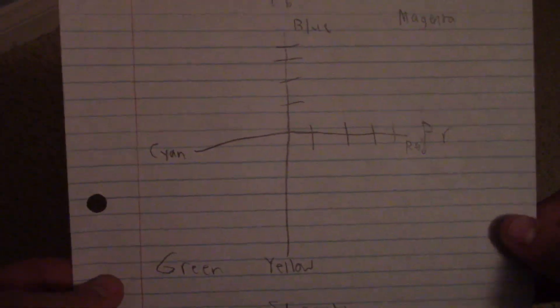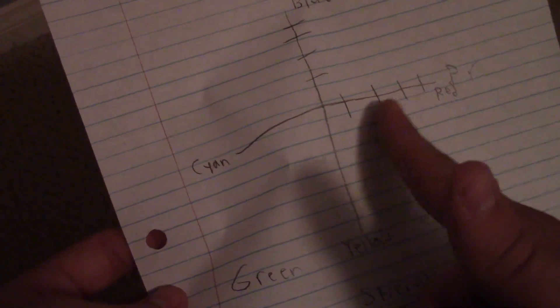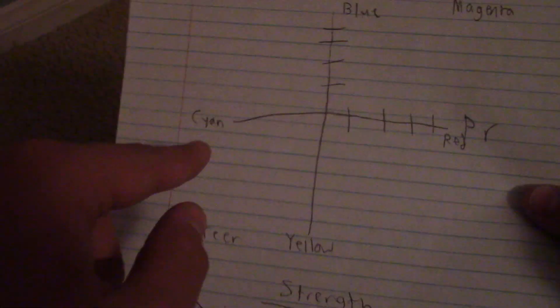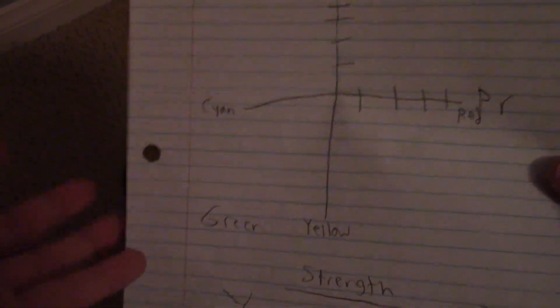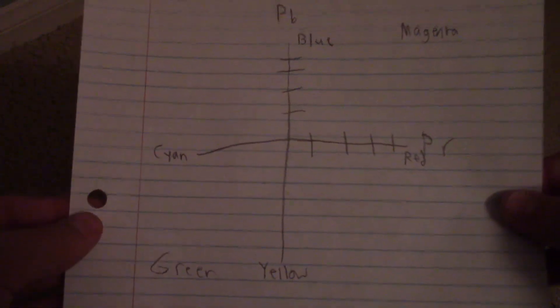This graph is actually a little bit shifted, so you get a more cyan-ish color on one side and a more yellow-magenta-ish color on another. I think the reason they do that is because this whole section would be just unwanted cyan and blue, whereas it's more useful with red, orange, yellow. They shifted it to keep the color more rounded in the color space. I'm no expert, so I can't modulate these myself or create my own circuit — though it's all analog; there are no digital conversions unless you're using YCBCR.